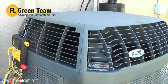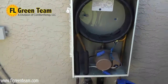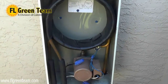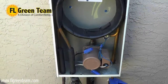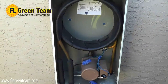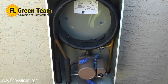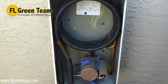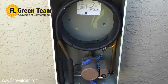We have installed a heat recovery unit into it where, as long as the air conditioning is running, they are producing hot water. It's a very simple device. A small pump, connected to your water heater, circulates water in and out of the water heater. When your air conditioner or heat pump comes on, water is drawn from the coldest part of the water heater and brought out to this heat exchanger, where it is heated by the hot refrigerant. The heated water is then returned to your water heater.